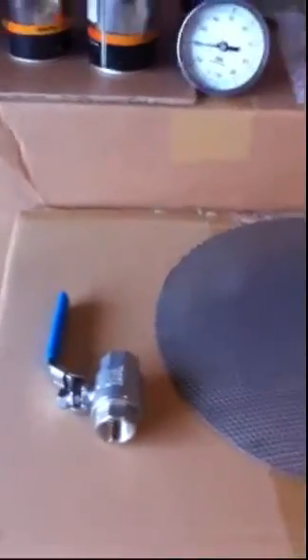I'm going to use this 35 litre thermos pot which a customer has bought. Having fitted a ball valve and a thermometer — a fixed head thermometer with a sunken fitting — this will be drilled out to a larger hole and sunk in between the layers of the thermos pot and a false bottom. The pot has been levelled and marked ready to go, with the tap at the bottom front and the sunken thermometer fitting offset to the right to sit a little bit lower in the pot.